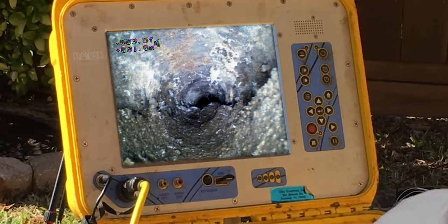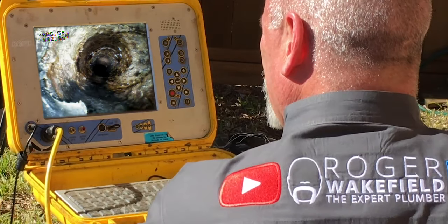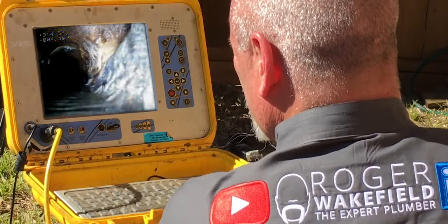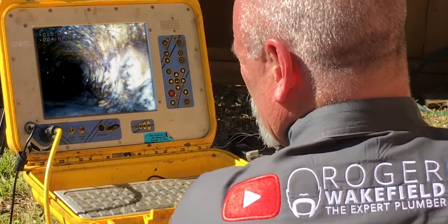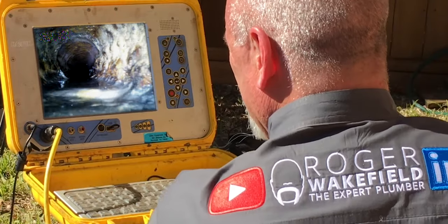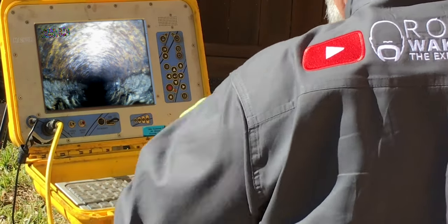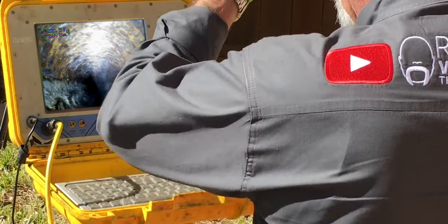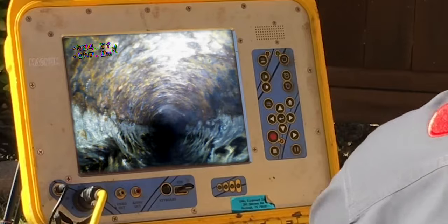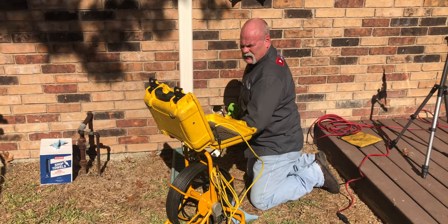I got past the blockage. There are more flies right there on top. I've got a little water in the bottom, so I know we've got some backfall issues — quite a bit of water sitting there. You've heard of channeling, and this is almost a sign of it: on the sides of the pipe it comes down and around, but at the bottom it drops a little more. The bottom of that pipe could either be rotted out or starting to rot out.